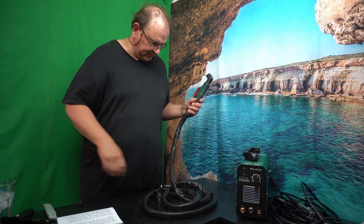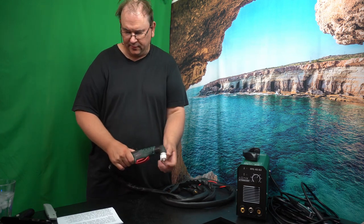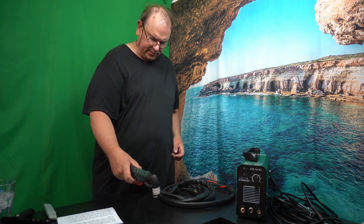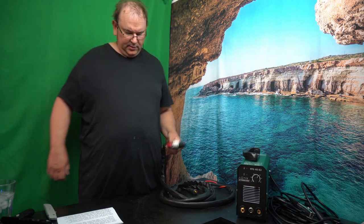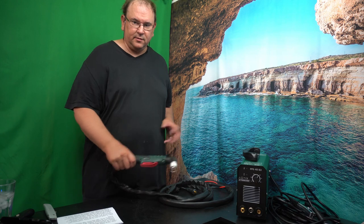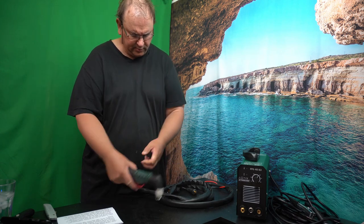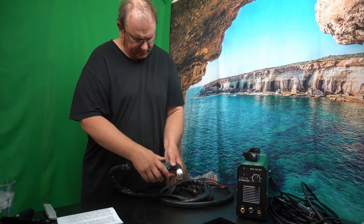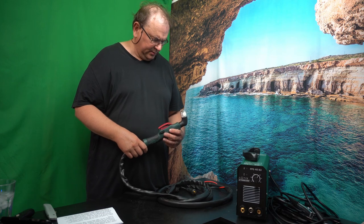The way these actually work is that this unit creates the voltage needed, and it's self-starting. When you activate it, there's a protection guard you need to move out of the way. When you start the plasma cut, you can actually trigger it before you hit the material — which is very useful, because with some plasma cutters you need to activate it against the material, which makes the start a bit messy. You come towards the material to be cut, and it creates the plasma arc from the electrode into the actual material, at 20,000 Celsius.